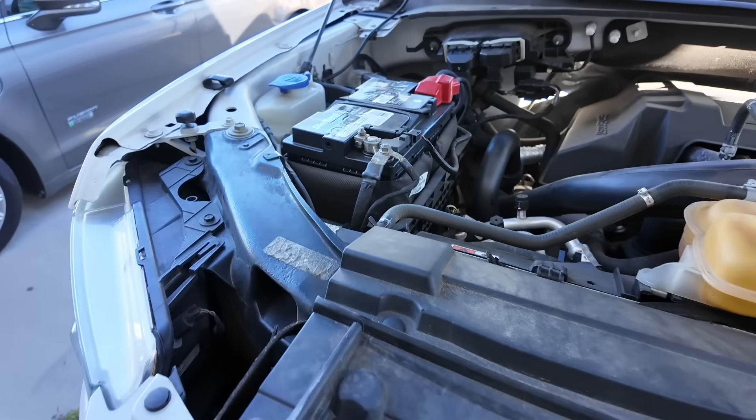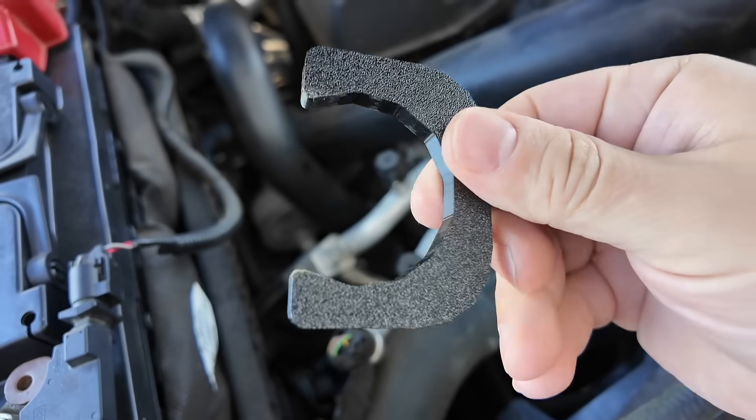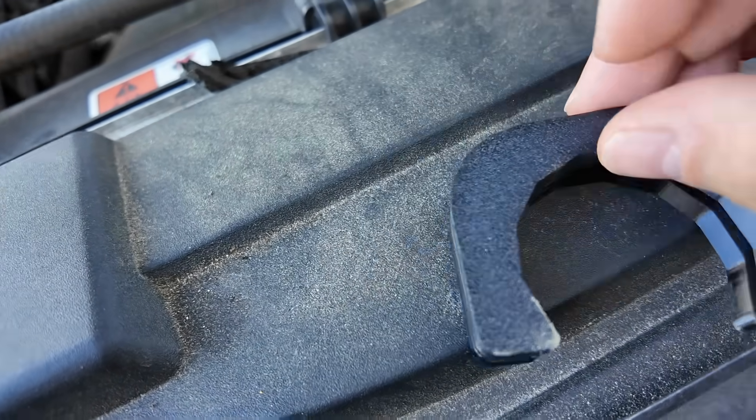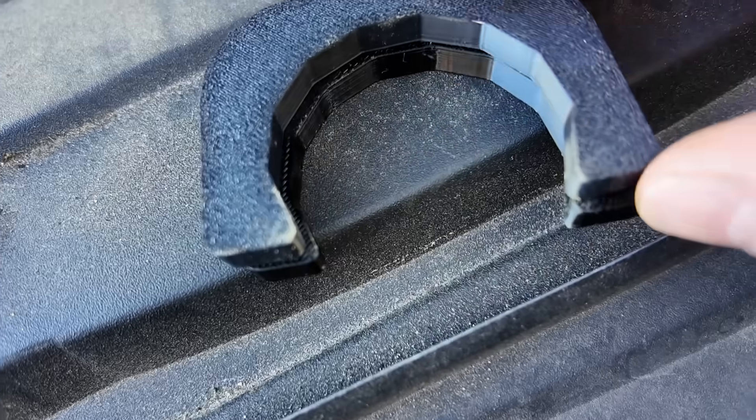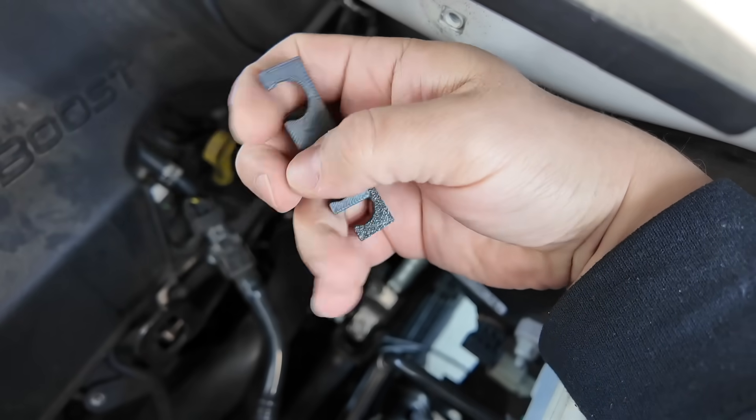Back home, the PC was well intact. ASA did show some slight changes. For both the upper radiator hose test clamp and our hose separator, PC had no warpage at all. You may be able to get away with ASA for parts that aren't too hot, and PC is UV resistant and holds up against water as well.